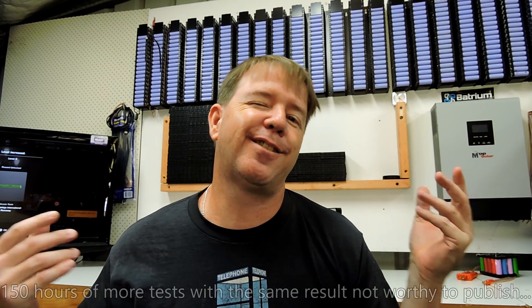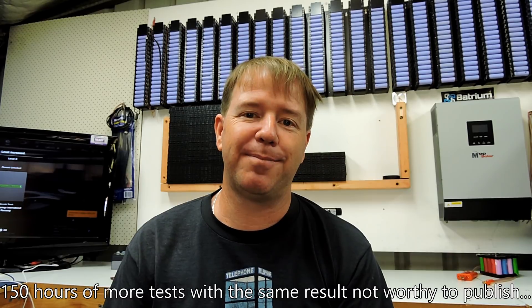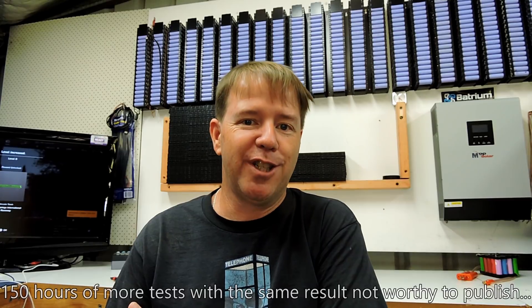I need some sort of conclusion to this video. It's taken way too long to test this cell 5 - it has been a thorn in my side, trying to get some reasonable footage that shows that this is bad. At the end of the day it's still running - I haven't pulled it from the pack yet, I'll do that later this afternoon. But it's just deteriorating faster than any other cells I have down there. It discharges faster, it doesn't charge all the way up. It's just weak - you throw a decent load on it and it just drops like a hammer.